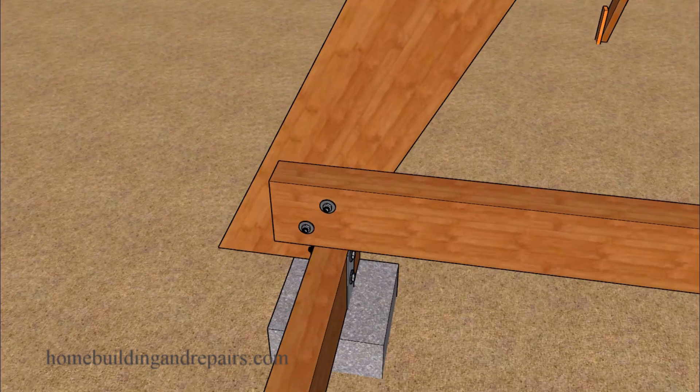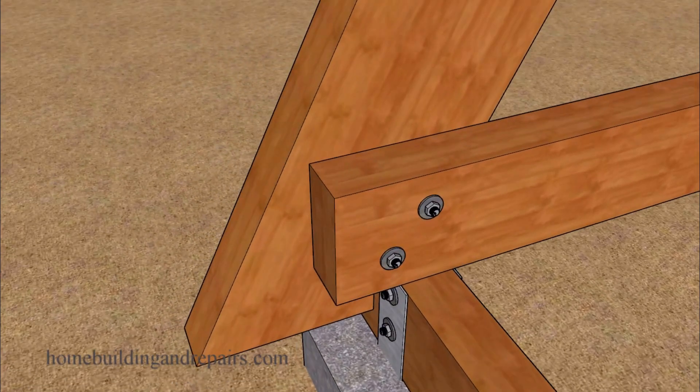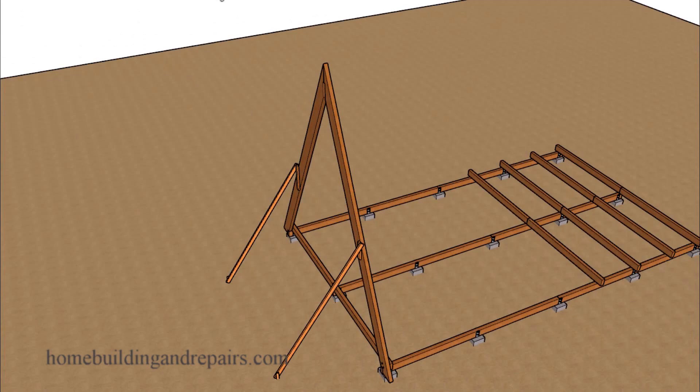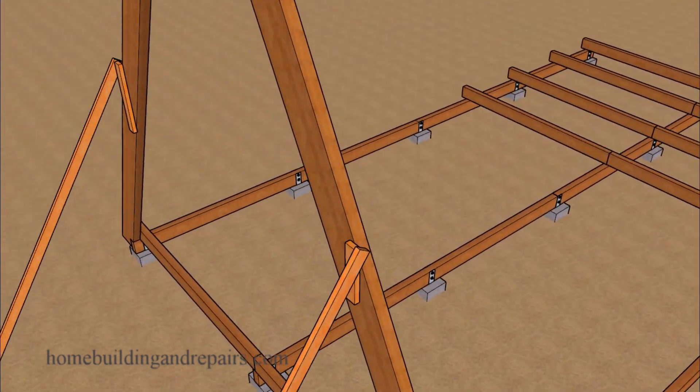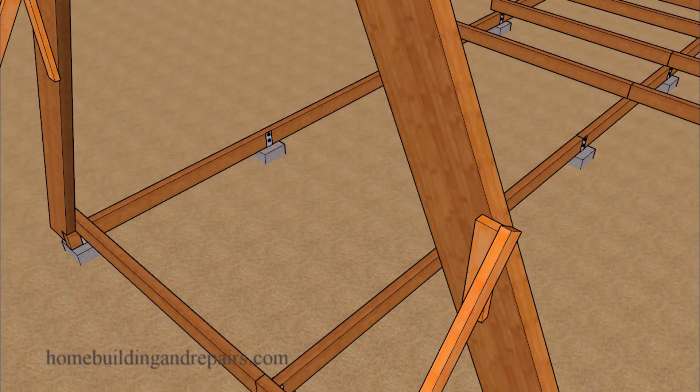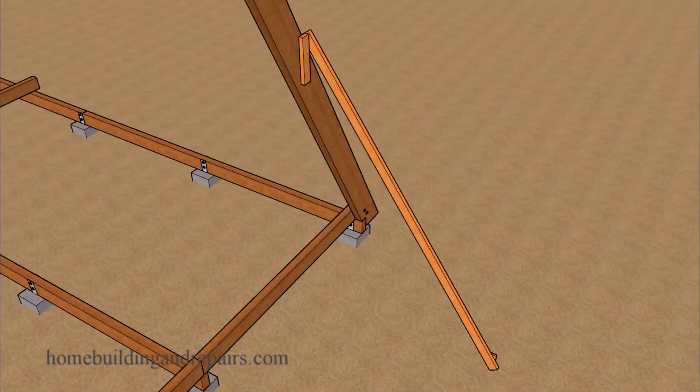I won't be able to provide you with the types or amount of bolts you're going to need for your specific project. Let's zoom in on the bracing. We can simply nail a block to the rafter and then nail our bracing to that block. You could always extend the blocks up a little bit; otherwise you might need to shape the top of the brace. We're using a stake driven into the ground, and we can attach the stake to the brace with screws or nails.